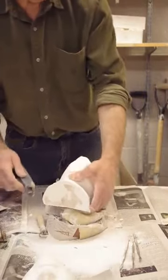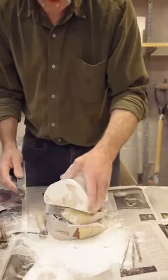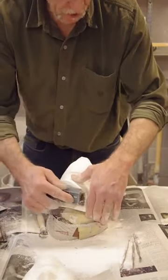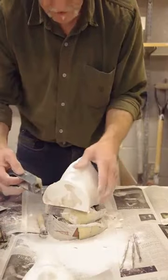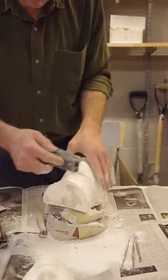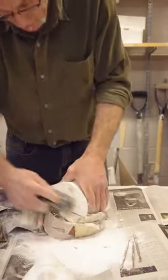Be careful with the hand that you're holding the piece. Don't get your fingers in the way. Because if the tool comes across and rubs against your knuckles, it'll take off some skin. So keep your hand well back of where the tool is moving. Very important.